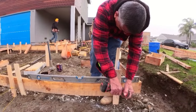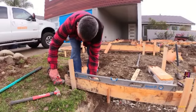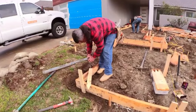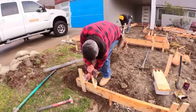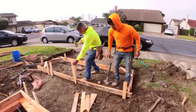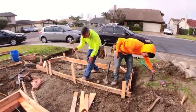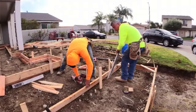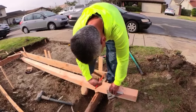Like I said, we're doing two pours. Generally with steps and stairs we use screws, but anything else we use duplex nails. It's easier to strip with screws. We stripped it and faced it that day, but we left the four-by-four under each lip until the next day.